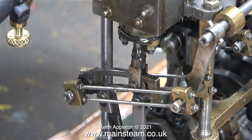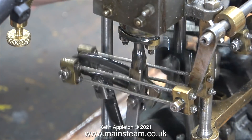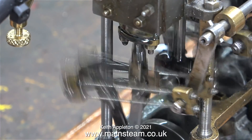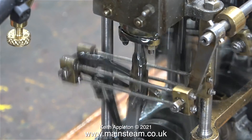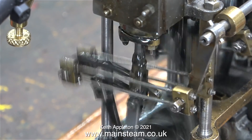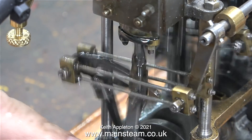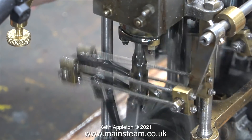I'll try it in reverse. In reverse the valve is too advanced - the crankshaft just oscillates, it doesn't go round. By changing the position of the reversing lever finally it does rotate but it's very lumpy - far too advanced. But nevertheless at least it is now running in a reverse direction. You can see on this clip how loose some of the parts are.